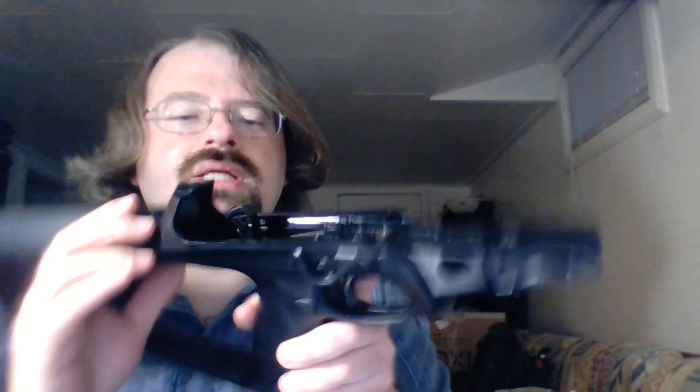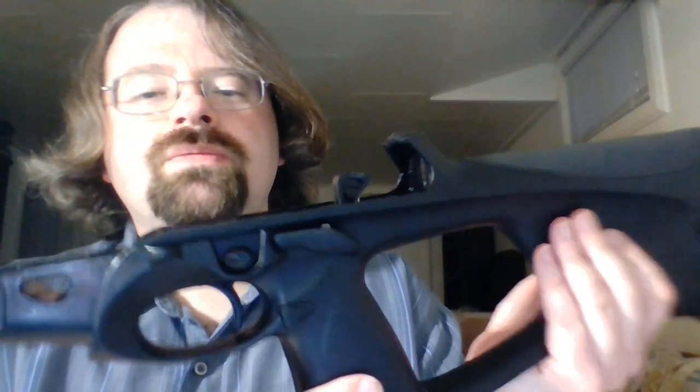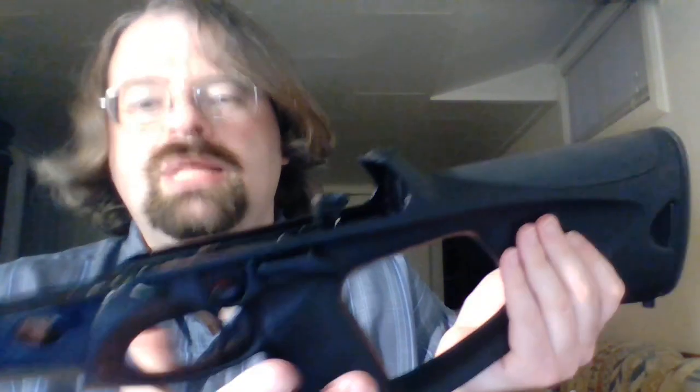And then another thing that is different just about the gun design in general is the design of the hammer. Now I'm going to go ahead and take it off safe, hold the hammer down and pull the trigger, and then slowly release the hammer. That's how you get behind the hammer to clean underneath and all that kind of stuff. But the reason why I'm taking it out and showing you guys this hammer is because I wanted you to notice what it is made of. That hammer is actually made of polymer. It's plastic.